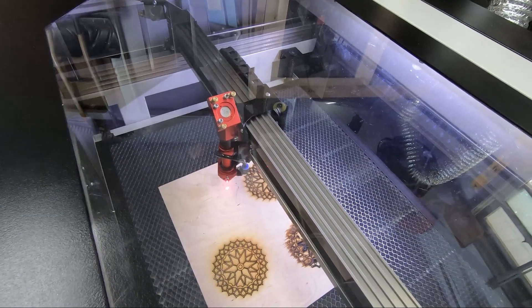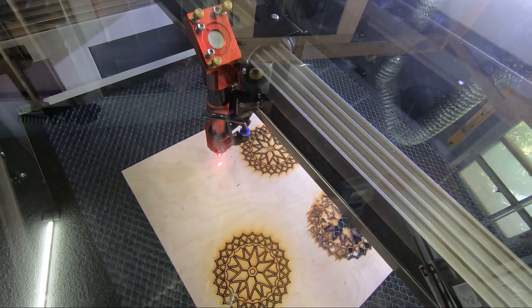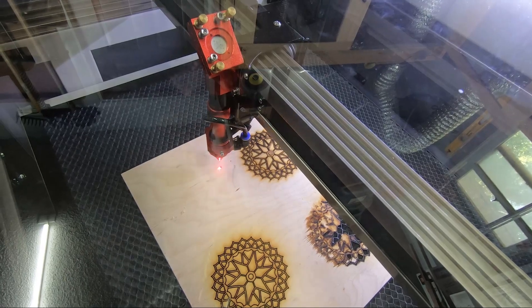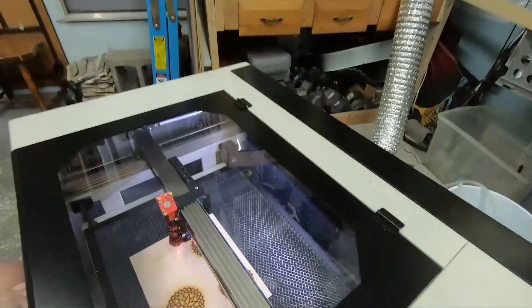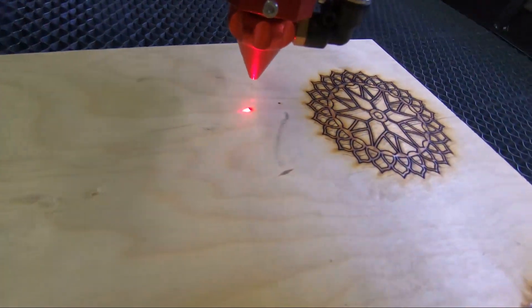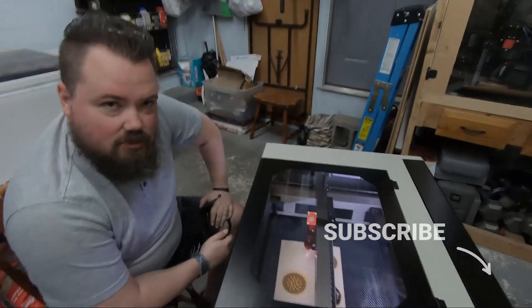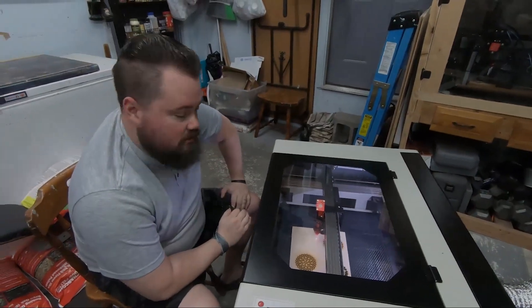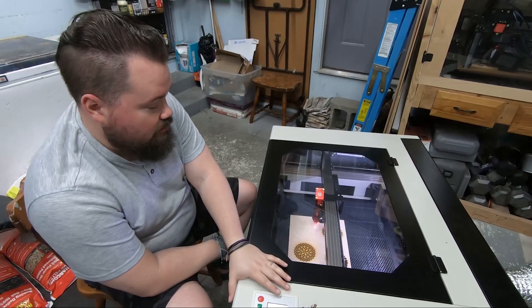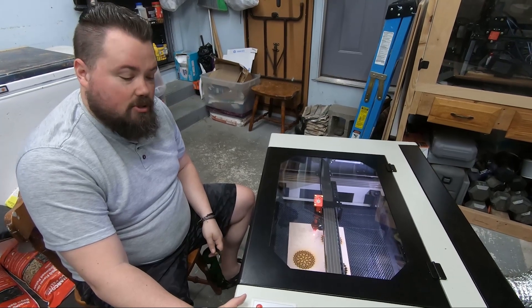I've moved it away from the dot so we're going to pulse it again and see how that alignment is. Here's the pulse. Let's see how close that is — that's just a little bit off from where it is. That's something that can probably be aligned. Before we do any kind of changing with the lasers, we'll test the autofocus. But we've got it burning and moving in all the right ways, so what I want to do is try to get it hooked up into the computer to LightBurn.